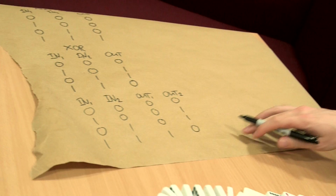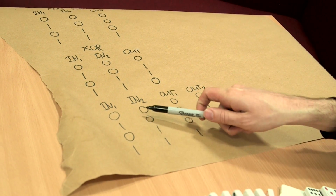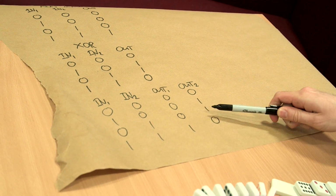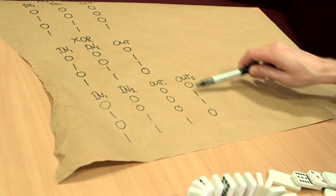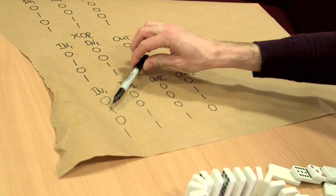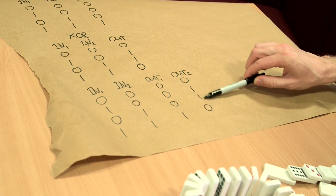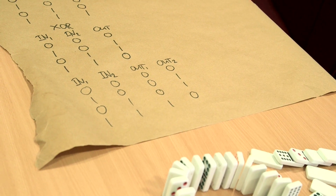And what that means is if you have both of these outputs for those 2 inputs, these are counting the number of inputs that get bumped. So this is like a units column, this is the ones column, and that's 2s. So if you only bump 1 input over, the 1 output goes. If you bump both of them over, you get the 2s column goes. And so this is a very, very basic circuit that can count. It can tell if you bump just 1 or 2. It doesn't matter which bump, it can still count it.